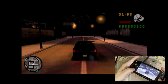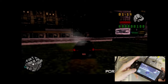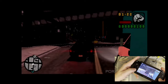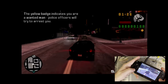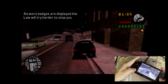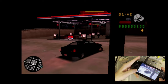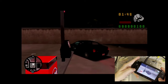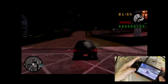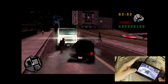So there isn't really a whole lot to configure. The kit just kind of works. You just plug it in and it outputs a 720p-ish signal, I believe. Actually, no. PSP should be a standard refresh rate, so it should be an actual 720p signal and not the kind of sort of 720p that a lot of Game Boys do. So what I mean by that is it should be 720/60. Game Boy kits will do 720, but they are 59.7 instead of a full 60. The refresh is a little bit weird. But this thing, since PSPs stock do output to a TV, the refresh rate is a little bit more sane.